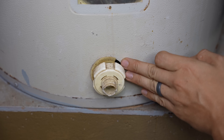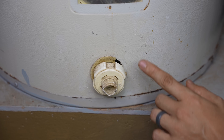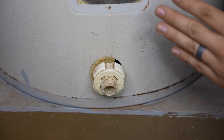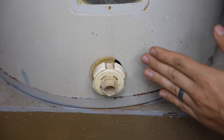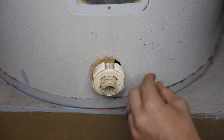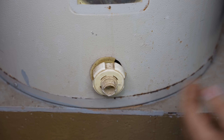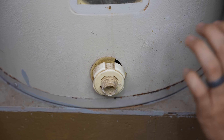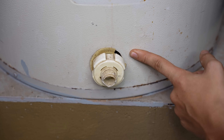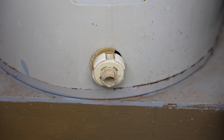On the very bottom of the tank, we have the drain valve. This is the worst kind of drain valve, in my opinion — it's plastic and has a ring that you have to spin to open it. Almost every time you touch these, it'll inevitably start to leak and you have to replace it. And when you go to replace it, this thing usually breaks off and then you have to chisel out that little piece inside the threads. If you damage the threads, then you have to get a new water heater. So it's a really tedious job.